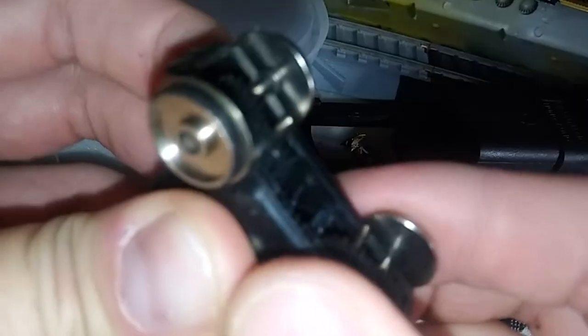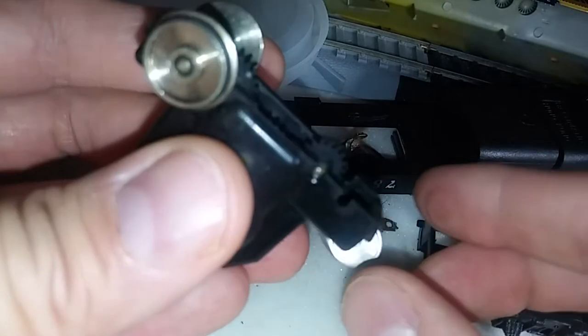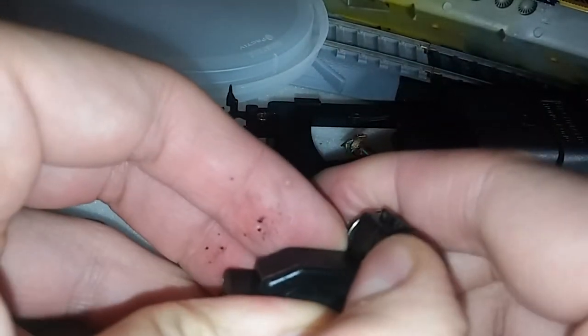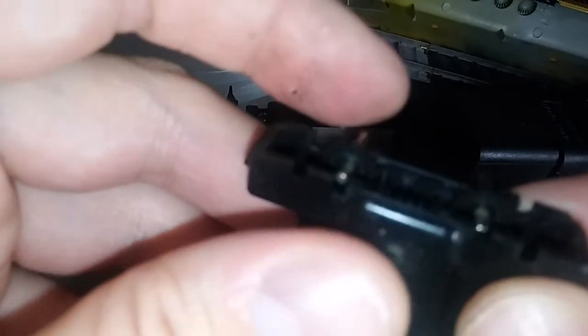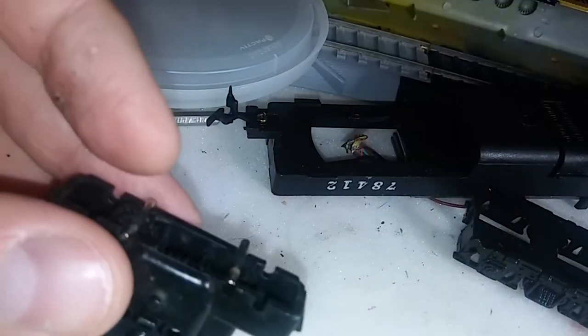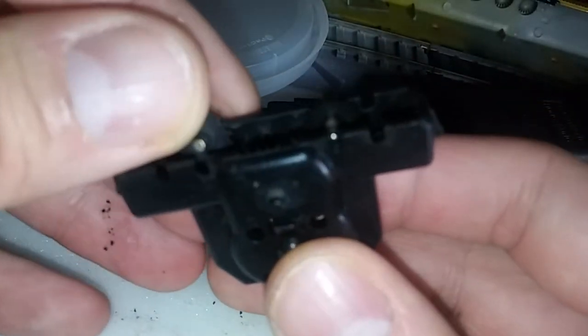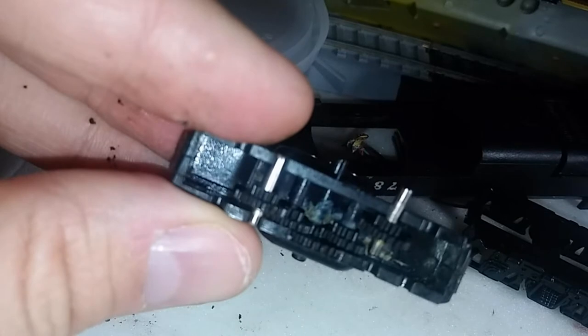That's the internals. Note the lack of wheel wipers in place — a good indication that this unit was scavenged for parts. This is pretty much academic at this point, but I'll keep going forward. Now we've disassembled the whole section here. I'm going to get these two gear shafts out. I'd also like to point out, in addition to the charred plastic remains on my hand clearly from the motor, that this early Mark I-style motor — as this is an early production pancake motor from Hong Kong — actually uses the black plastic gears, not the infamous white plastic ones that are known for cracking.